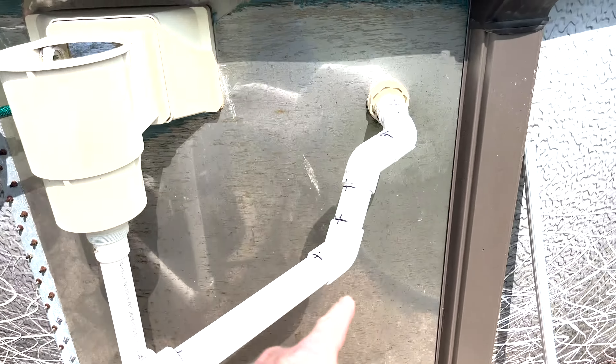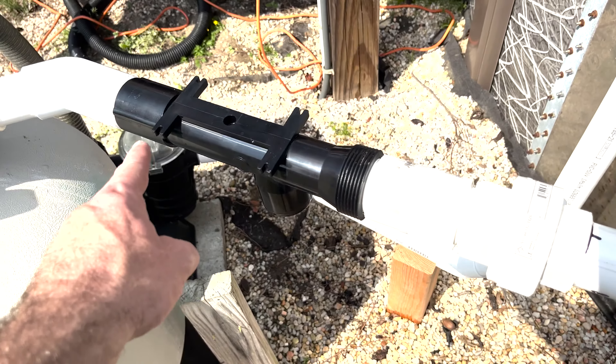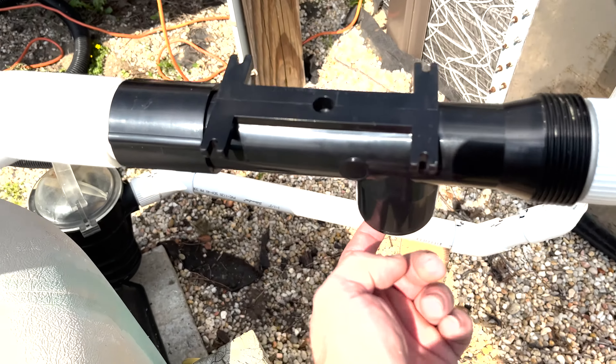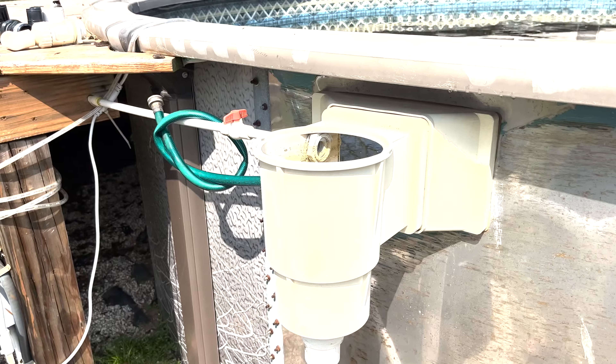It's all plumbed in and glued up. I got that last fitting - a bulkhead fitting threaded on both sides in inch and a half. To temporarily stop the water while it hadn't fully drained below the inlet, I got an extra threaded coupling, put a doubled-up Walmart bag on it, and lightly screwed it in - and it blocked the water flow. All of these connections are glued up and work out very well. I have the removable union so I can just unscrew it and pull the pipe aside to replace the ionizer section. If you have any questions about servicing that device - I've even replaced the copper anode bars inside to save money - let me know in the comments.